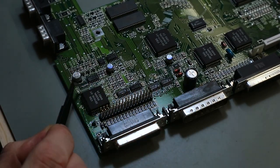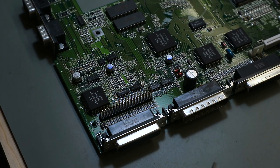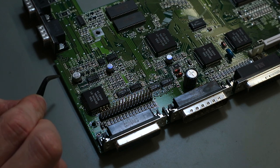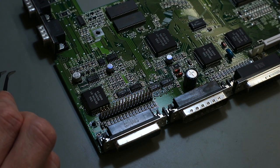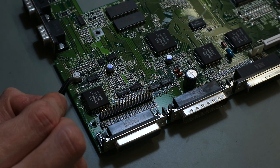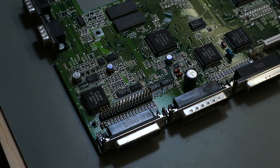So these two pads are ripped off with desoldering of the capacitor. So I take copper foil and cut some small rectangles, and here is the trace, the one trace from the positive side, and there was a little rest of a trace from the negative side. And so I stick the copper foil on the old positions and solder the traces on the pads.